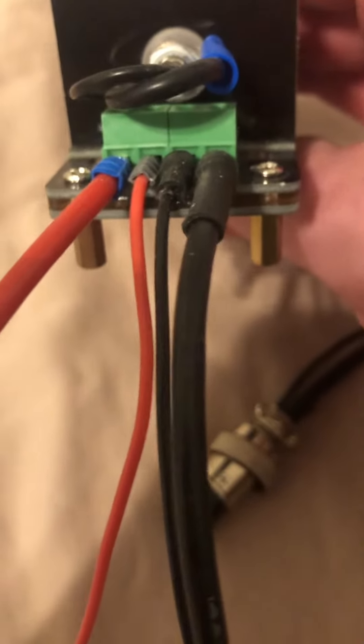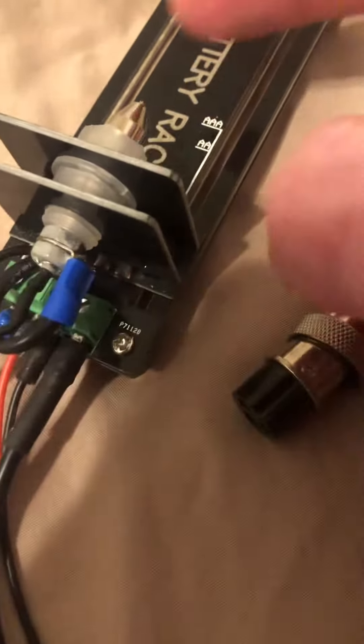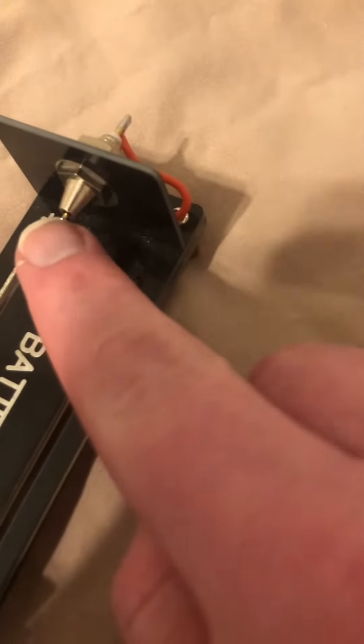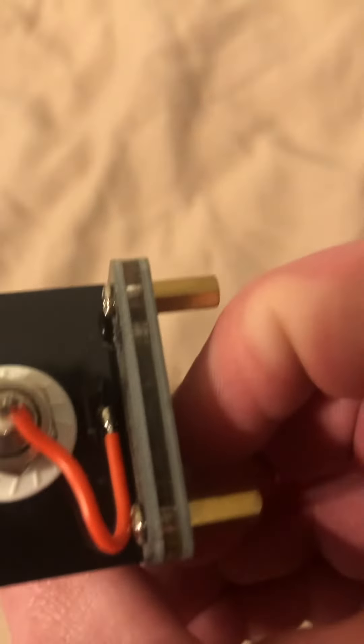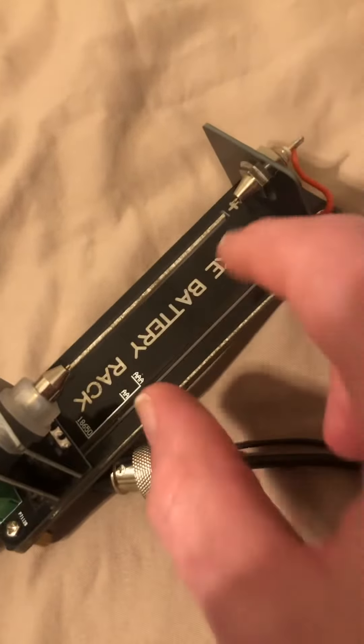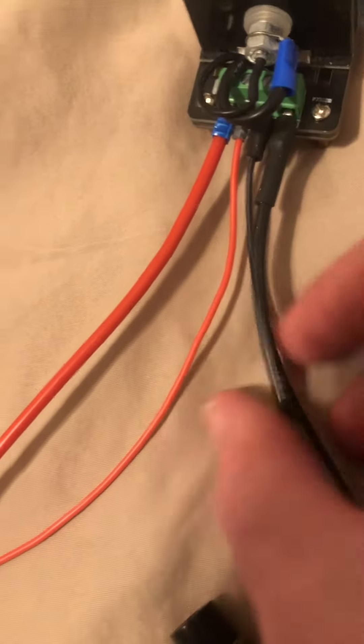You have four terminals — the outer ones are for current only, and the inner ones are for voltage sense. Back here you have a thick wire for current, and the middle one that goes to the point is for voltage sense. Same thing on the positive side — that's voltage sense. Not a great solder job. I'm guessing the current line for this one is inside the body and then comes up to the terminal block, which is why you don't have the thick wire out here.